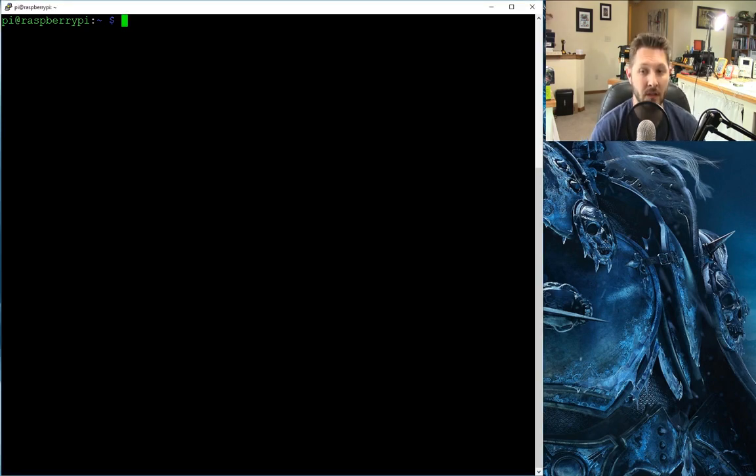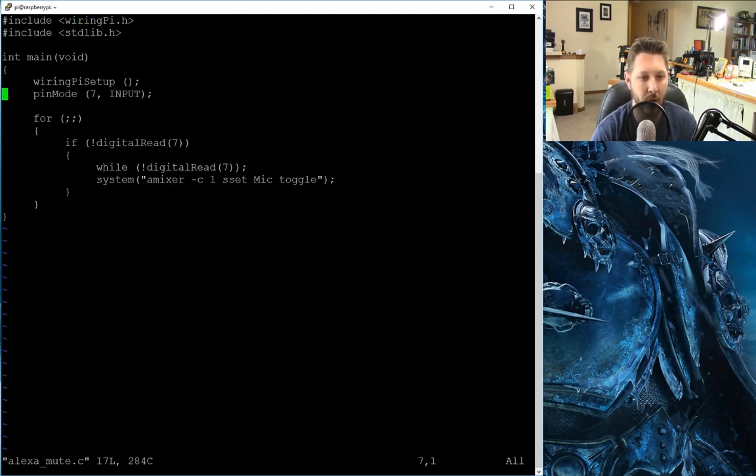So I've cleared things out now. Let's go ahead and check out the coding for this. I'm going to vi — I have already written a script here. I have connected up a pin. On the actual header it is pin 11, which is GPIO 17. Now, with wiringPi you have to look on their website to see what the actual pin numbers are, because they number them differently. I'm going to put a link in the description so you can see what pins are labeled what as far as wiringPi. It has to do with the way Broadcom numbers things.